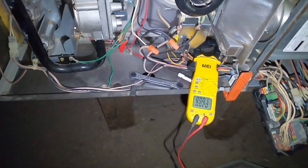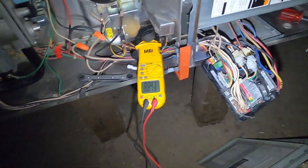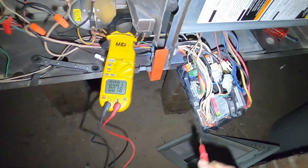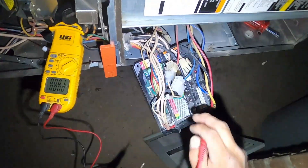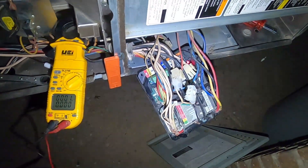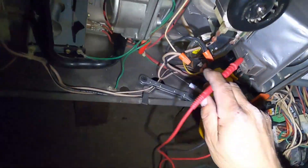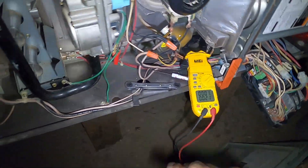I think we've covered just about everything on troubleshooting — it's not very difficult. If it's stuck and seized, it's a pretty sure bet that you're going to need to replace it. But if you're not getting 120 volts, then you've got to do the troubleshooting: make sure your control board has voltage from the thermostat, and make sure you have voltage coming from the board to the inducer. If you do have voltage going to the inducer but it still doesn't turn, then the motor windings are probably shot.